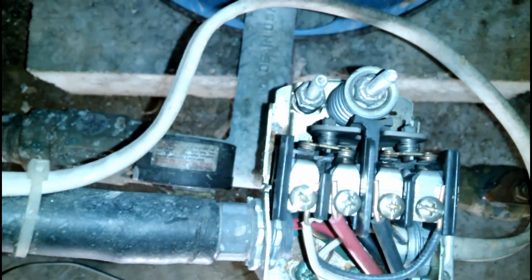Some people think the one on the right is the high range and the one on the left is the low range — that's not what it is. The one on the right is the overall range — essentially the spread between upper and lower. If that range isn't sufficient, you adjust the screw on the left to get a higher range. So the right is range, the left is above the range — even higher than high. I don't recommend going over 60 PSI for home plumbing. The switches are rated for certain pressures. Right now we're sitting at about 50 PSI.